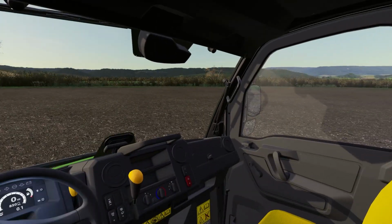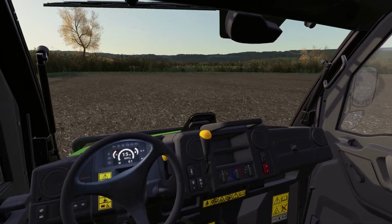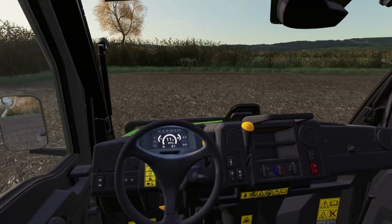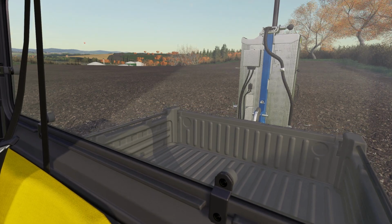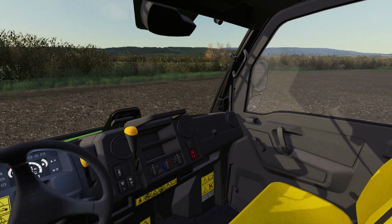My monitors in my Claas tractors and the Amazone Pantera do allow plug into the variable rate application software, so I can see what I'm putting down there at any given time, which is pretty cool. The sprayers have auto shut off, so when they get to an area which doesn't need a specific fertilizer, if I'm putting liquid fertilizer down, it will cut it off and it will stop it. Same thing goes with the drills.